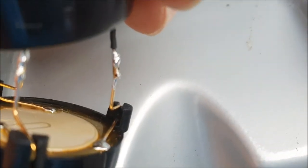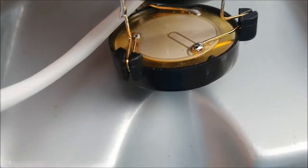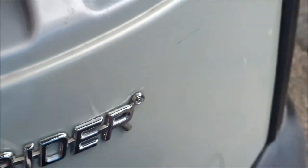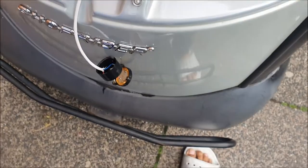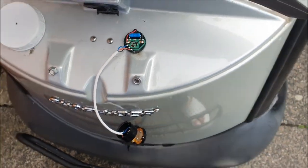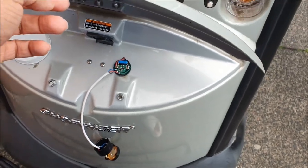So to recap: the feedback wire is in the middle, the black ground wire is on the outer terminal, and the red positive wire is on its terminal. It's working like magic. I'm going to take it off again, shorten the cable length, and put it back on.